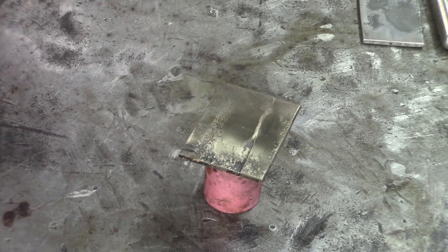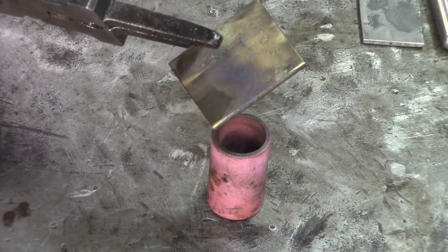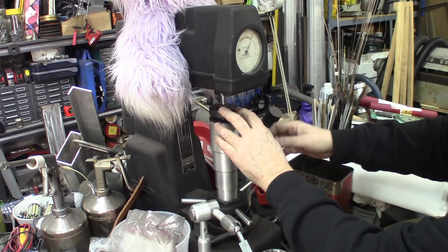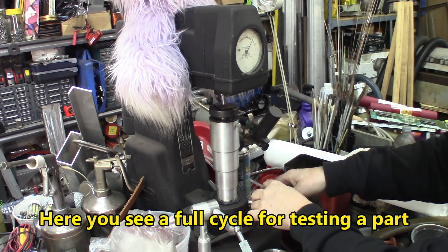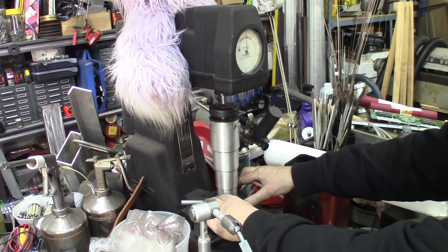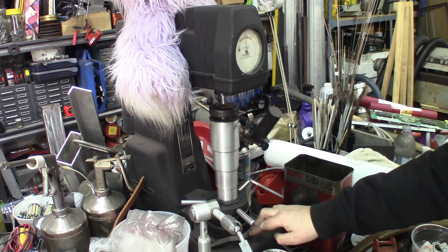This is number three for the oil treated — let's try to bring this one to more of a yellowish color, between yellow and brown. I'll be turning it a few times. This is more delicate; the least heat you want to input, the more delicate it gets. I'm heating as slow as possible, trying to let the heat sink in. Yellowish, brownish — this is water number three brought to a yellow straw color, exposed to less heat.